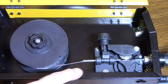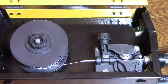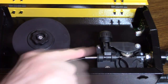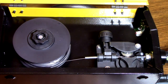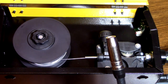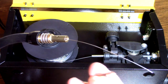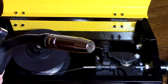Here I have the unit powered on and the wire fed. Make sure the feed arm is clipped down first to help align it, then it'll start going into the cable of the tip. Every time you hit the control button, you can see it advances the motor, sending that wire into the tip. We wait for it to come through into the actual tip — and there it is. I can put the expendable tip on and I should be ready to start MIG welding.